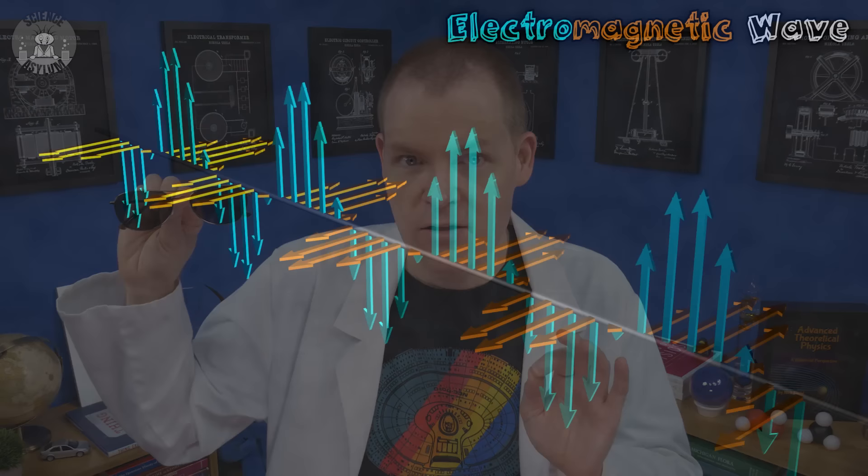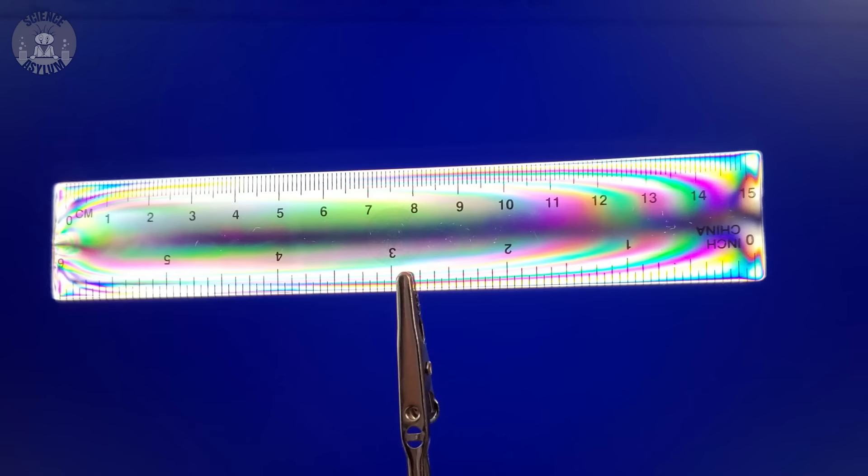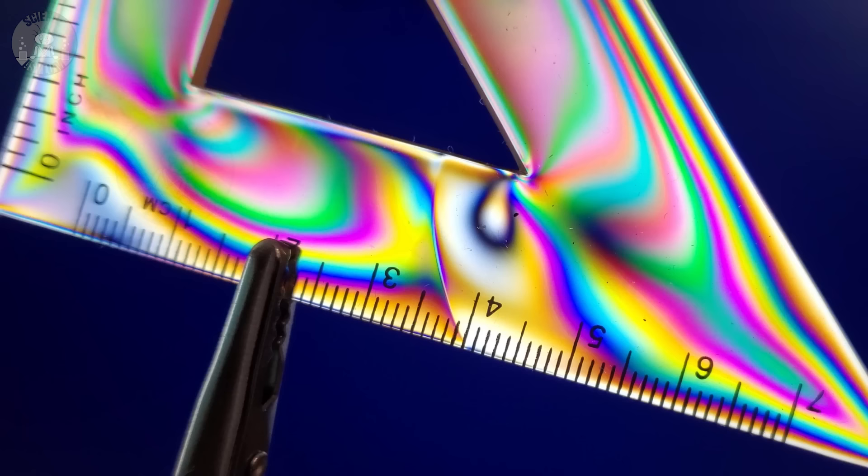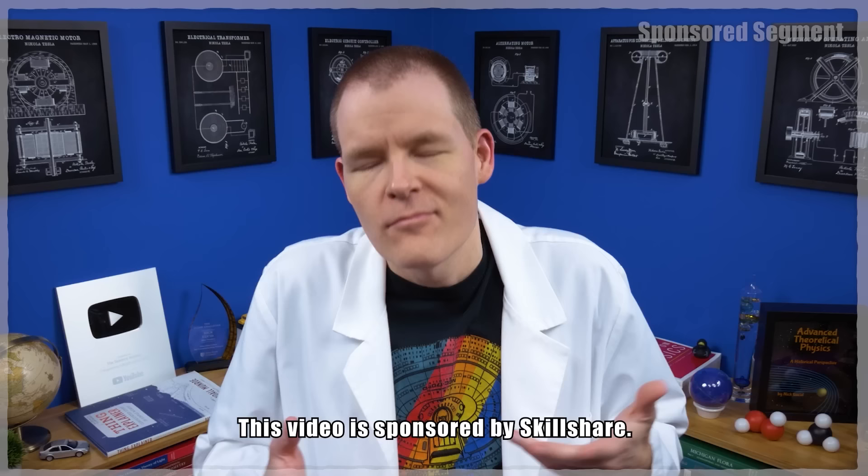Not that I anticipate ever being in that situation, but better safe than sorry. Super main ultimate point: if you have a pair of polarized sunglasses, then you have a powerful scientific tool. They let you see the orientation of light, a property otherwise invisible to us. With that new power and an LCD screen, you can peer into the internal structure of a material. You can see where it's already under stress even before you do anything to it. Think about that the next time you see spots in your car window.